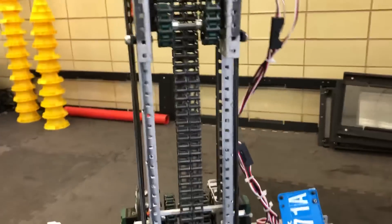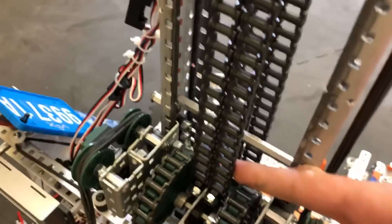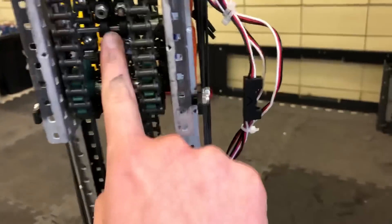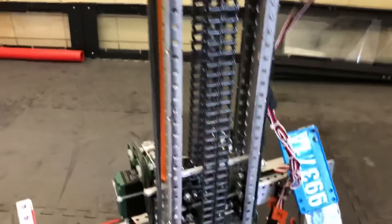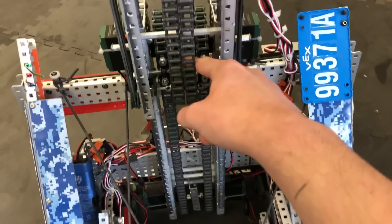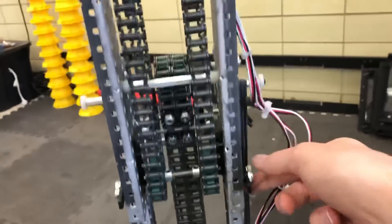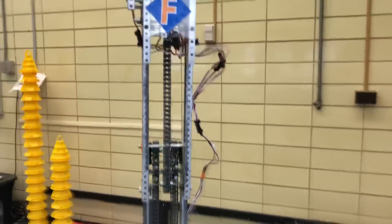The next stage does a very similar thing but it has to do it in two places. The next link, which isn't connected to any motors, is just linked around itself — again two links for strength. It's connected to both the first stage, where you can see the perpendicular bearings, and also to the third stage right here. When this stage is forced upward it holds the chain in place, forcing the chain to spin, and those connections force the third stage up. Using this mechanic you can make a cascade lift for theoretically infinite stages.